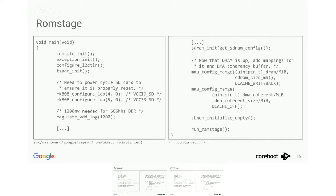We also can't use LZMA for early stages because LZMA requires a big 16K scratch pad and space to first load the compressed buffer before decompressing, and all of that probably doesn't fit in SRAM. So we switched to LZ4, which has no internal memory overhead when decompressing and can decompress in place — we load our compressed stage to the end of the ROM stage region, then decompress from the start of that compressed buffer to the start of the uncompressed buffer, overwriting itself without requiring any more space. After this, we run the ROM stage, whose main point — like on x86 — is to bring up memory. Sometimes we raise a voltage rail first or initialize thermal shutdown. The main thing is the SDRAM function, which is normal open-source CoreBoot code with no FSP or closed memory reference code.